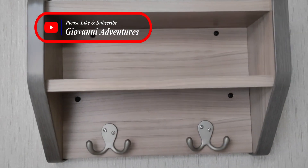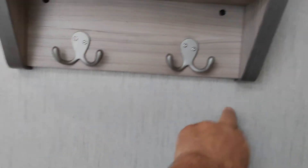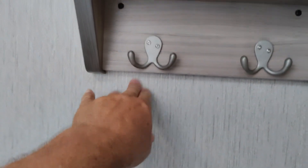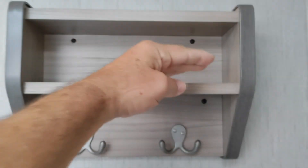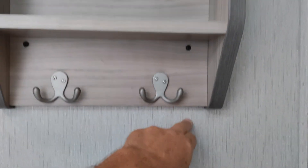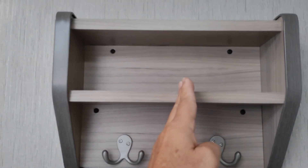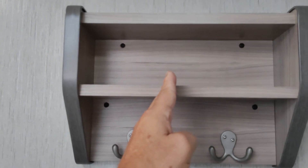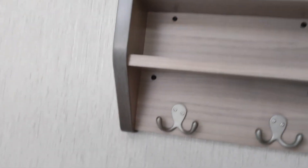The second thing I don't like is the towel holder — the wood is only thin, about one-eighth of an inch. There's some support behind the panel, but the whole thing was starting to tilt down. The holes on one side were getting elongated. I was lucky enough to move it over by an inch to catch wood behind the panel, and it's now pretty solid. I fixed that.